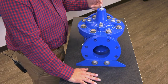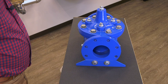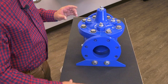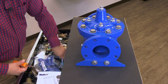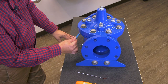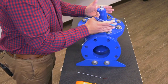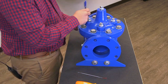Now we're going to take some pictures. Get your phone out and take some pictures of the valve. Make sure you know how that pilot system is going to line back up onto that valve. Then we're going to make a witness mark — take a screwdriver, a pen, whatever you have — and make an indicator from the cover to the body. We want to make sure we get this cover back in the same position for those pilot tubing connections.